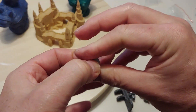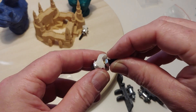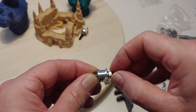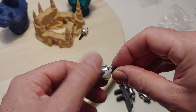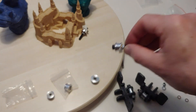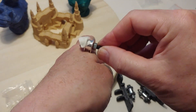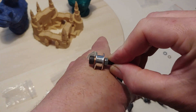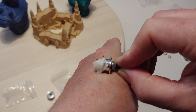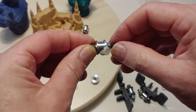Let me open a toothed one from Mellow — these are much smoother. I'm adding them to a bolt with a flag so we can see if it moves. I have precision shims here, which are important — you need them or else this will not work. I tighten this by hand and you can see we can turn it easily. Very smooth. Now let's check the cheap Chinese one. Same setup, tightened by hand — and it does not roll. I'm trying to force it to roll, but it barely goes around. The bearing is slipping. This is a big difference, and a huge impact on the smoothness of your 3D printer.